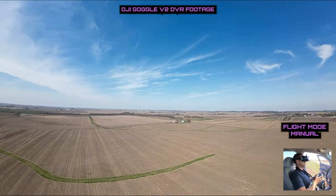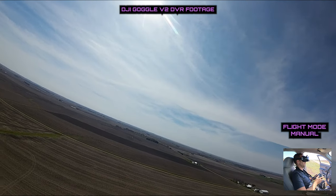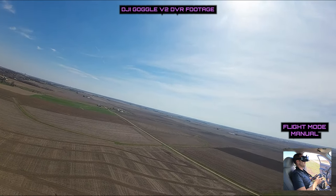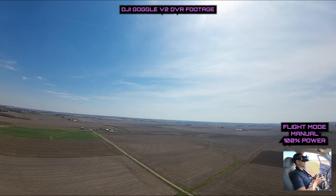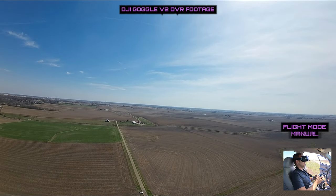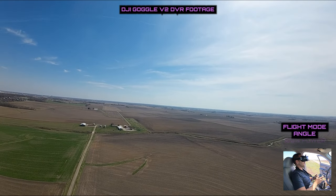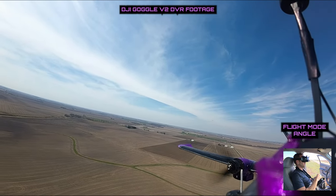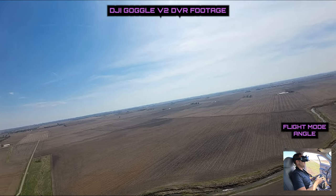I'm going to put it in manual mode — that's going to tell us a whole lot. Flying into the wind, I stab the throttle full and she does not climb like before. She climbs a hair but that could just be the wind. Put it in angle and stab it 100% — she did good. Washers definitely fixed it, that was an easy fix. Both wings look good.